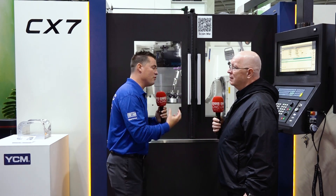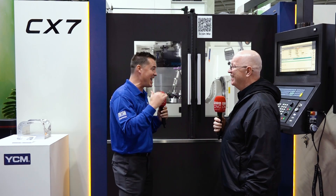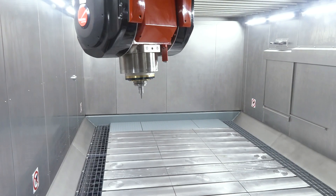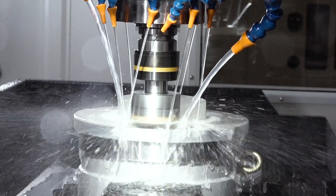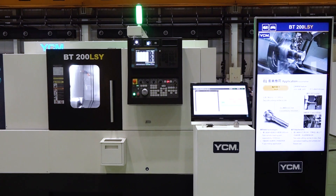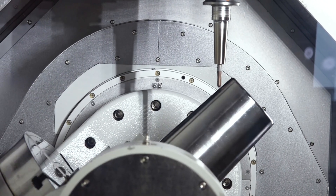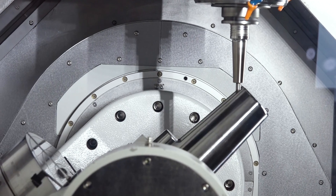One of the more frustrating things is programming something that on the table was perfect, but as I got 10 to 15 inches away from my table, the accuracies I thought existed no longer existed in that realm of space. We also have spindle thermal compensation and scales on all the axes — we make all the necessary design and development features to give us accuracy throughout the range. It doesn't matter what solid 5-axis we're doing — all of our machines have linear and rotary encoders. It's important to have a machine that's accurate throughout the range of all the parts you need to cut.